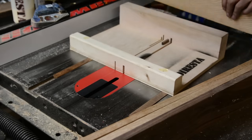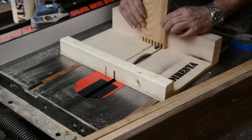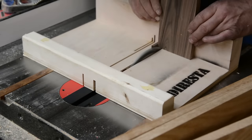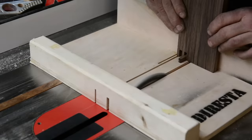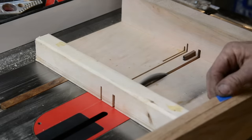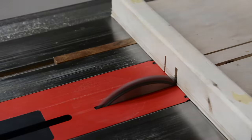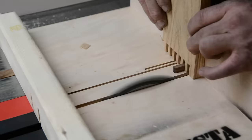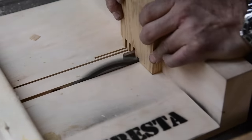I'm just cutting and cutting and cutting. The most important thing — because I'm cutting them individually rather than in pairs — is that I know where the top of each side is, so they all puzzle together facing in the right direction. That's why I put blue tape on them, so I know each side is the face-up side. It's just a matter of how you start on your box jig, whether it's going to be right over the hole or right next to the stopper.